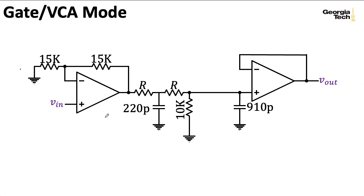In this particular case, this structure in front is a non-inverting amplifier configuration that gives a gain of 2. My guess is that Don Buchla figured out he needed to put this in here to overall balance the levels between the various modes of the filter, so the musician doesn't feel things are jarring when switching between modes—that's just a guess.